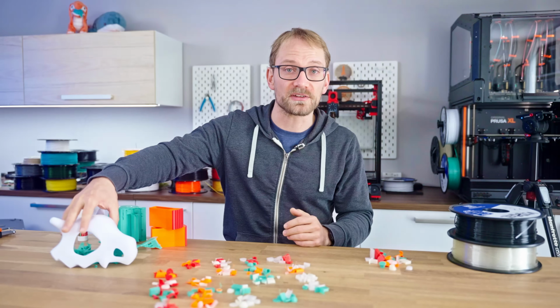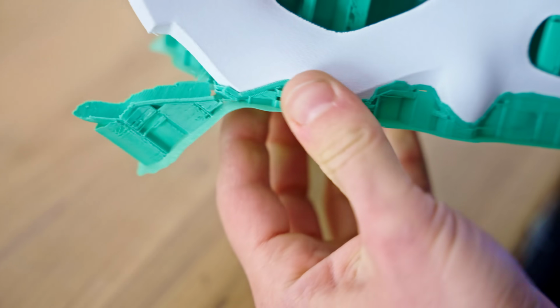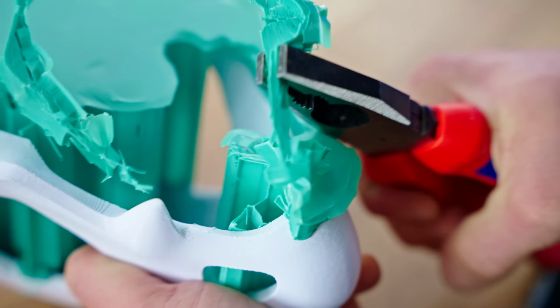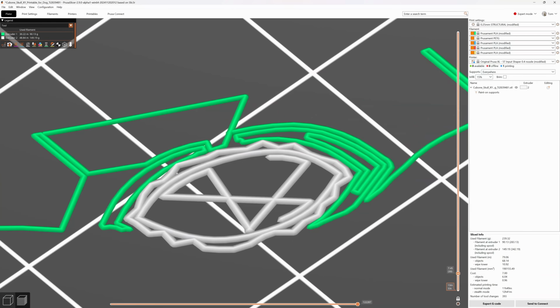I actually noticed this with the Cubone skull where I had fuzzy skin enabled for the entire print, and even the PETG supports on the PLA print were a bit harder to remove than I expected. Support material gets generated for the ideal surface geometry, not for the fuzzy one, so these did end up keying together a little more than I expected.